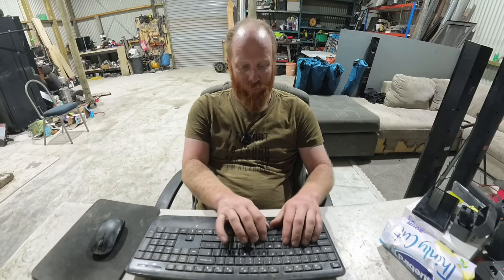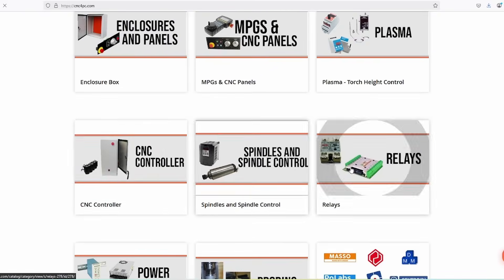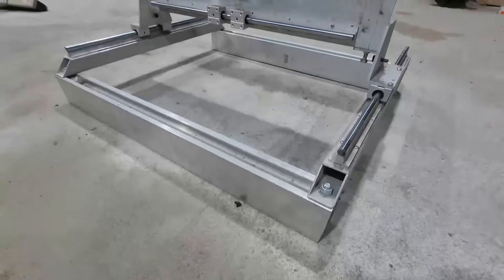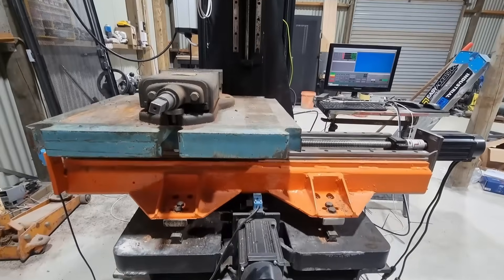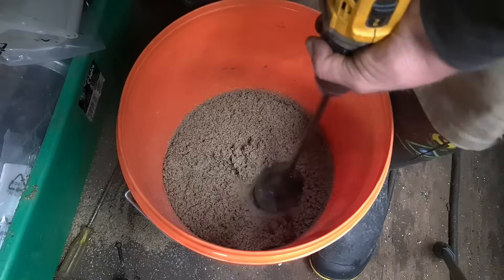So you've browsed online for CNC parts but the options felt overwhelming. Let's simplify. First, we've got to think about the frame. Aluminium extrusions are great for mid-range machines cutting hardwoods and aluminium. A steel frame offers maximum rigidity for metal cutting. In my own build, I used a full steel frame made from thick boilerplate and epoxy-filled box sections.